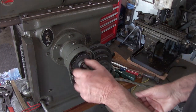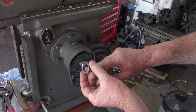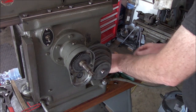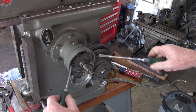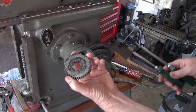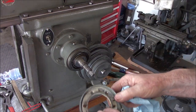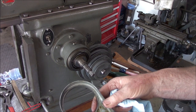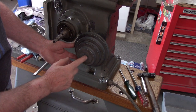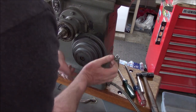It wasn't real tight and I got that collar off. The set screw has some type of lead or soft metal insert in there so the set screw does not bear down directly on the threads. This gear was not on there real tight but it did take a little bit of effort. Did the two-screwdriver method and just worked it off. It's a Zamak gear with a key and a series of screws in a screw pattern. As soon as I turned the camera off I realized this was two-piece — it actually fell apart, so just watch out for that. I already pulled the set screw on the drive pulley and the grease cap. Got a little burr on this shaft somewhere or on the pulley.